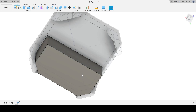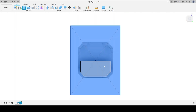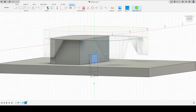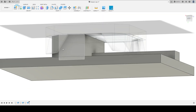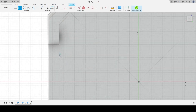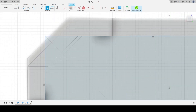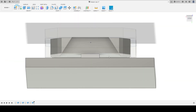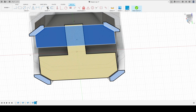I extended this out to create the first half of the jaws, and then created the base that I would be able to clamp down to the bed. None of this was exact — I was just eyeballing it. Then I created the rail that the second set of jaws is going to ride on to hold it all parallel. I wasn't thinking ahead very clearly at this point — I would have created the grooves that hold everything in place initially, and made that piece a whole separate item. But this is all still the same component in Fusion, which means it's the same object, so I can't move the parts around or modify them as easily. In retrospect, I would have made it a separate object altogether to be easier to design.